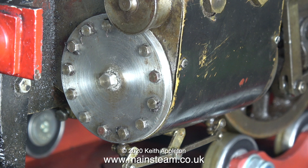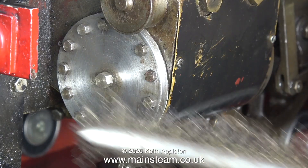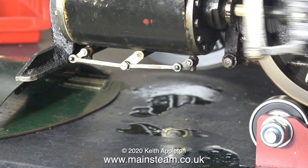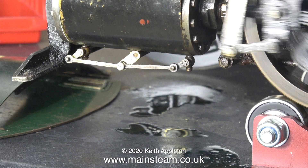Unfortunately, there is some silicone rubber still sticking to some of the bolt heads, but my brass wire brush makes short work of that. Time to run the engine and make sure the drain cocks are working. I'm pleased to say the drain cocks are working fine. To check the drain cocks on the other side, I had to move the engine off the bench onto the bigger bench and then put it back again. The back drain cock was blocked, but the front one was okay.